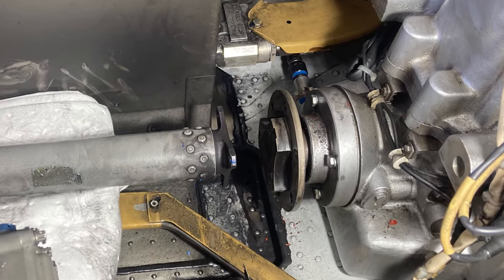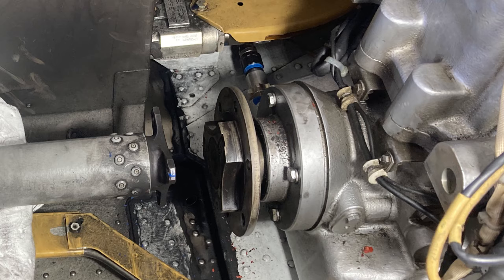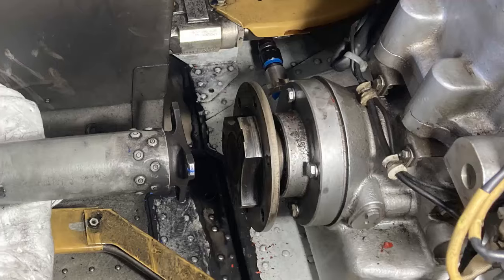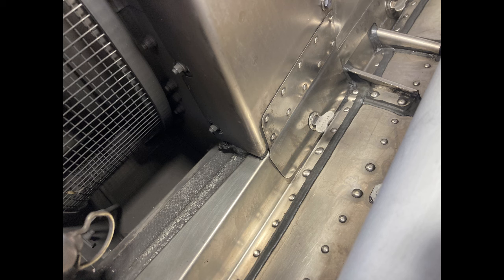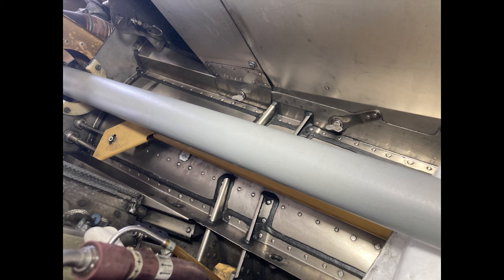Anyway, it's super dirty up here, as you can tell. So since you have all this stuff apart, now is the time to come up here with a spray bottle with some soap and a brush and clean the crap out of it, because this is the intake tunnel. So clean it, then hose it down, and then wipe everything dry. Look for cotter pins and all sorts of stuff. Whenever you're up here, clean the tunnel, because behind these 2 flanges you could find cotter pins and cut safety wire. They get caught up in these little angles here. So clean them, and it gets super dirty.